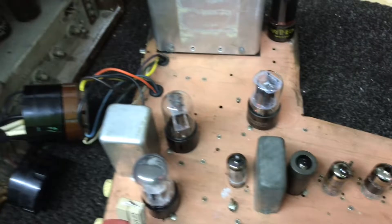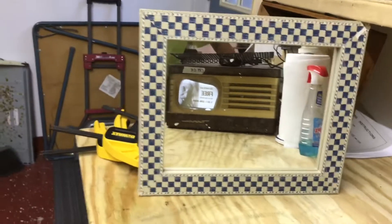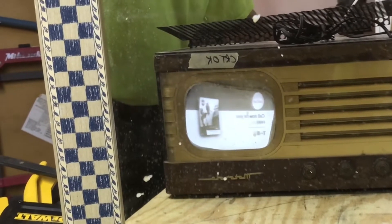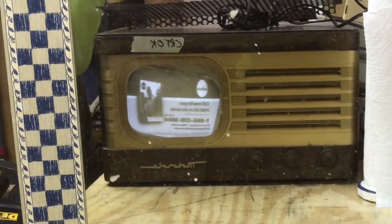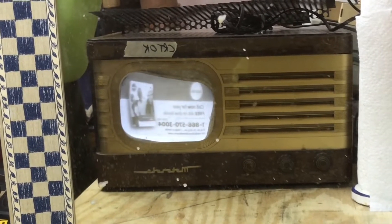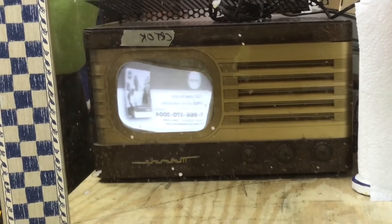The filaments are good because the tube is lighting up on the chassis. It's a little tilted and the mask has dropped down on the left side, but we've got a pretty bright tube here. Focus is adjusting good, and good contrast. The chassis has a little detent in the brightness control - that's why it jumps up suddenly. So number five - I'd call that excellent.